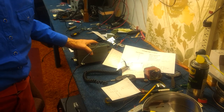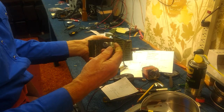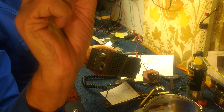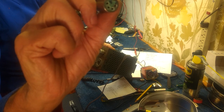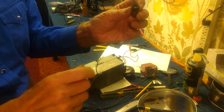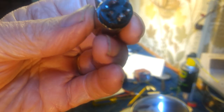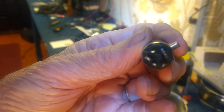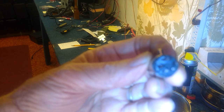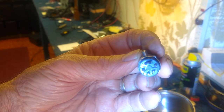A handy way - the only way - to hold that plug while I wire it is just to plug it into the amp. These new plugs are really tight. There's that four-pin female side of it. Remember, they're numbered - it's hard to see. The number one is on the left and they're numbered counterclockwise: one, two, three, four. Four is the one on the right.